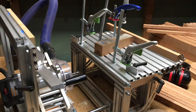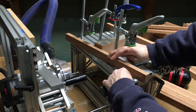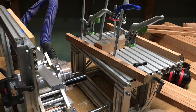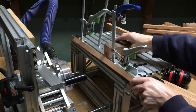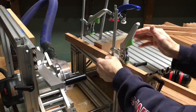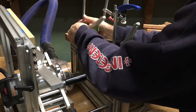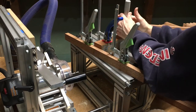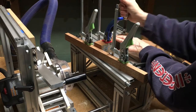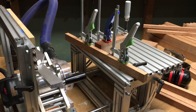The setup on the pantorouter itself — I've got my braces here set at the perfect angle. Bringing this up, you can see that my angle is right where I need it when it's flat against both of those surfaces. Additionally, I'll be setting up this block here as a backer board so that I don't split the back side as that router bit comes through. Rough side is up; that'll be routed away later on. That means the top side of the stretcher is down against my table — that's my nice flat side — and then I can clamp that in place. That block will stay in place for all the pieces because it's still going to support the piece where it comes through.